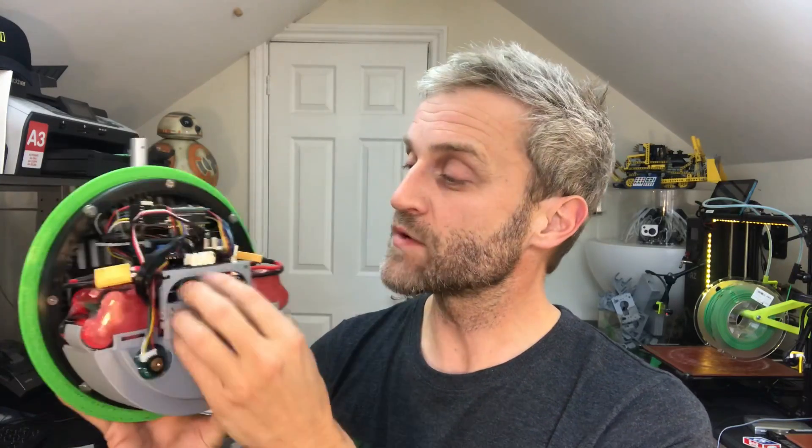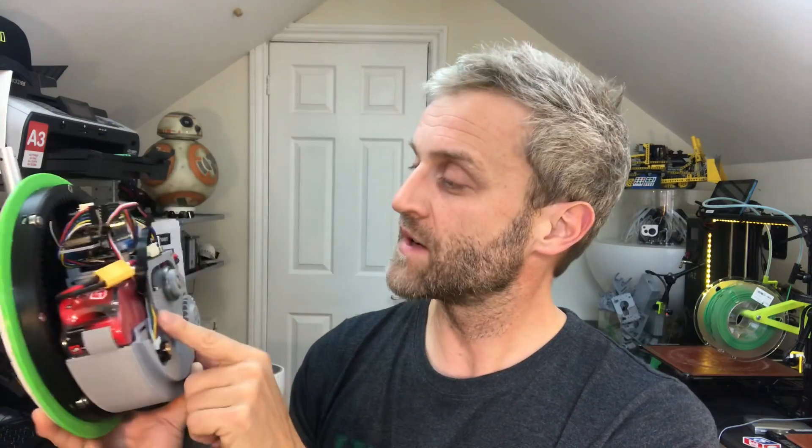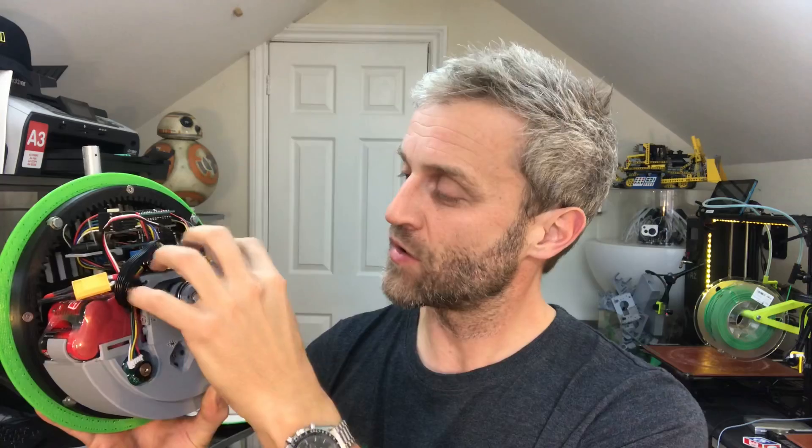The HT1 does run a little warmer as standard, but so far it's been quite happy keeping the neck running for prolonged periods. It does all get quite warm inside here now with the DC-DC converter and the two servos, so I'm going to watch the temperature in this core area — maybe I'll have to put a little fan in. But for now it seems much happier with those servos and I'm getting a much smoother motion out of them.